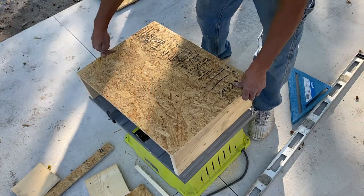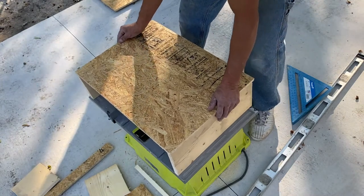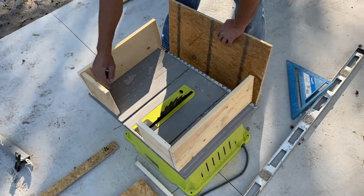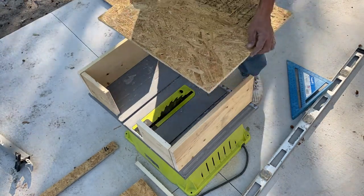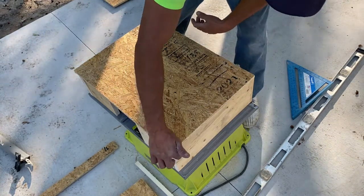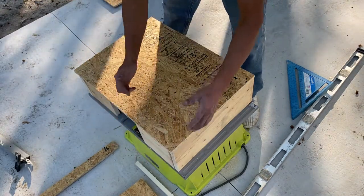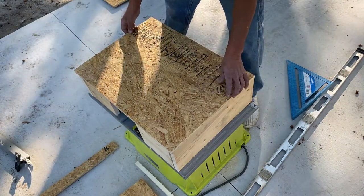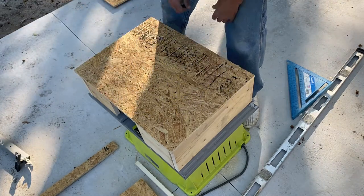I may have to put in a couple of blocks on the underside just to get some stability — we don't want this thing wobbling. I took these scrap ends and put them right there. As you can see, it's going to be hollow straight through, just to give it more stability. I'm using two-inch drywall screws. I'll pre-drill to avoid splitting the wood, then drive screws in all the way around and on top — that should keep it from wobbling and let it sit down nicely.